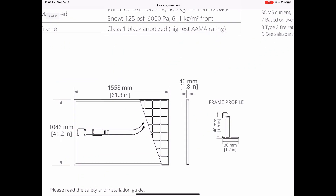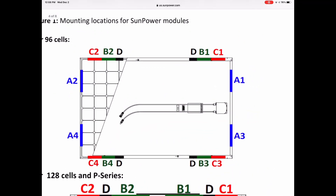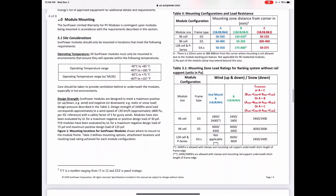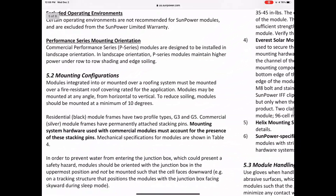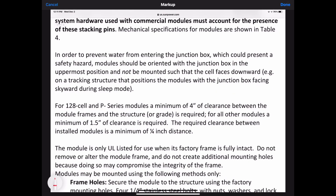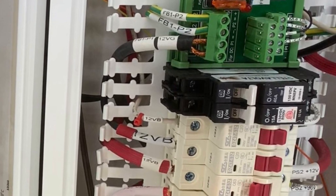You can see the small size — 61 by 41 inches — is pretty small, so they fit on my van. The DC coupler had to be tilted in a certain manner, so I looked at the design installation specs, which show you everything you need to know about how to mount them. They should be mounted at a 10-degree angle to reduce soiling. So I mounted mine on an angle for not only reduced soiling, but to prevent water from entering the junction box, which can be a safety hazard. I tilted them about six or seven degrees, not the full 10.